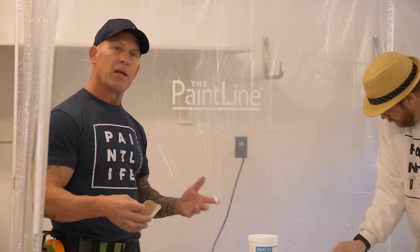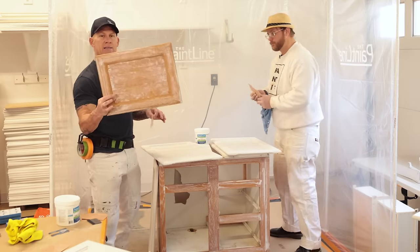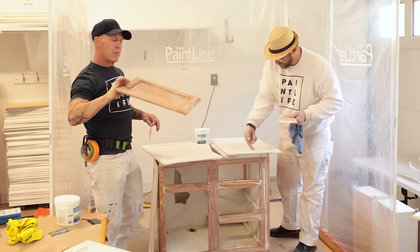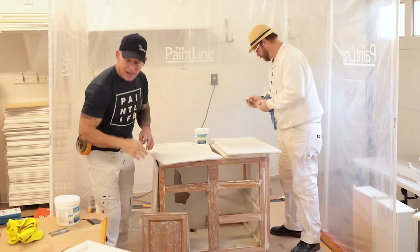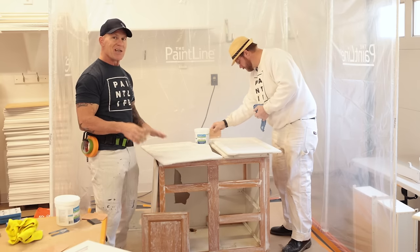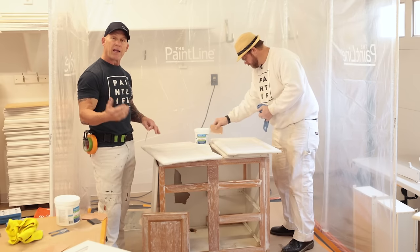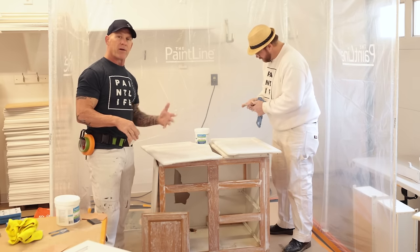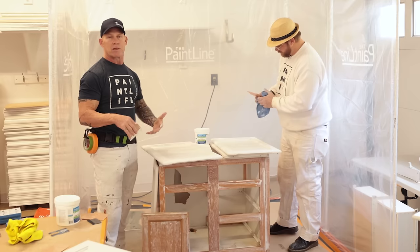It's the same with applying grain filler on these oak cabinets. You can see the grain. What's the client's expectation of the end result? After they're painted, this is gonna be painted white, you would see really dark shadows and holes and pinholes in that. And 90% of the time, the customer is not gonna be happy with it. So we use AquaCoat to fill the grain. And I go over that with the customer's expectations because I charge more to do that. But I make it very known what the expectations are, that if you don't apply the AquaCoat, this is what they will look like.